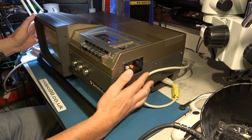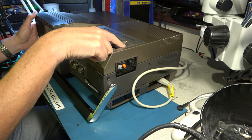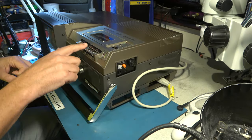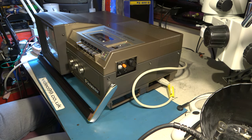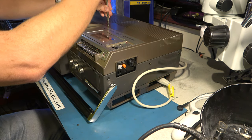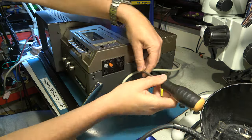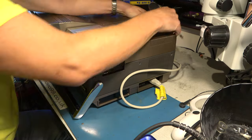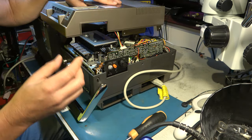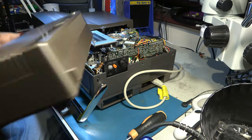Let's take the top off and look at the mechanism. When we remove the top it'll take out the battery meter, tape counter, these couple of LEDs and the memory/rewind-to-zero function. But we can just unplug that — we don't need it, so we'll lose those features; it doesn't matter. But we do need to remember which button is which. I'll switch the power off. The monitor side is a different sort of component so you're not likely to get zapped by the tube when working on this side. I've taken the top off. This particular screw only has to be slackened to get around there — it doesn't have to be removed. We'll take the top away to give ourselves more space.